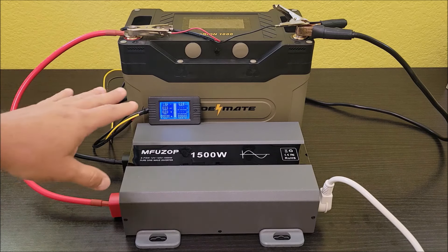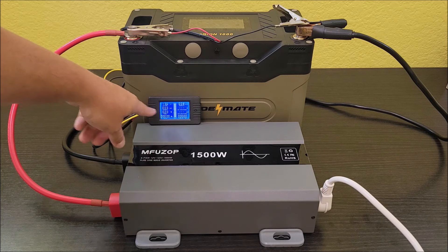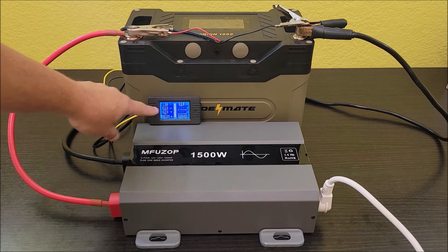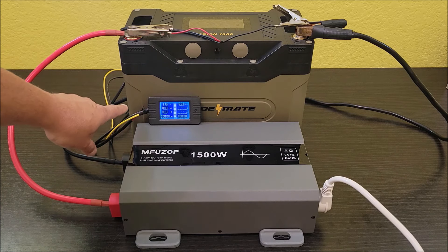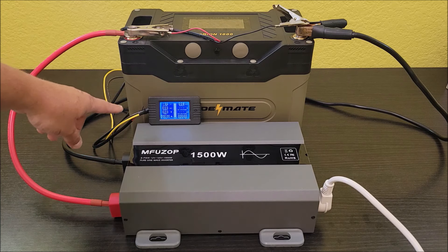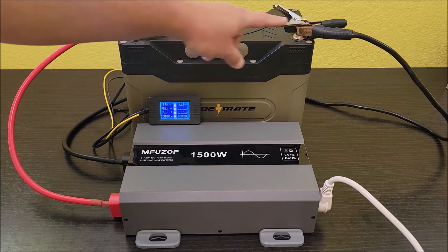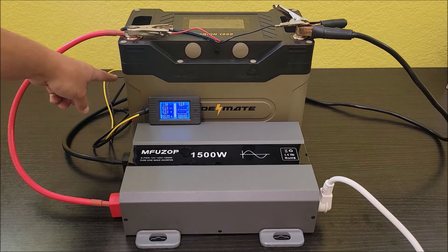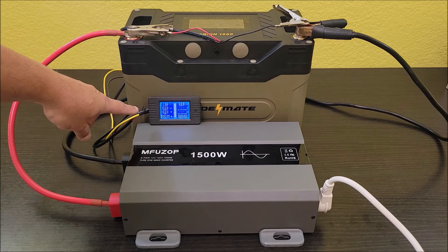So here's what I've got going on. The battery is now fully charged — it's reading 13.6 volts, was 13.7 just a moment ago, but it's at its resting state and it is fully charged. I reset this battery monitor here. I know it's not an expensive battery monitor — I get comments about that all the time — but it does exactly what I need it to do. It's monitoring how much usage is coming from this battery via a shunt on the cable behind the battery, which tells us basically everything pulled out of that battery.